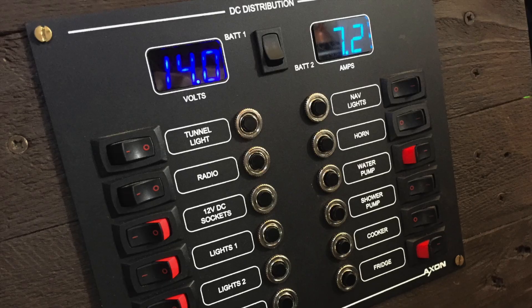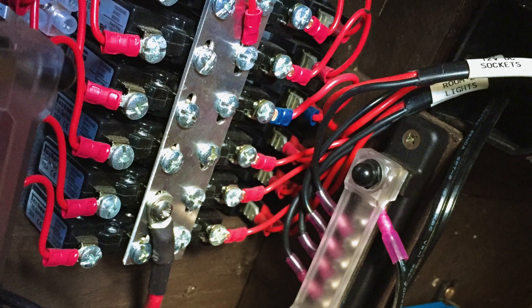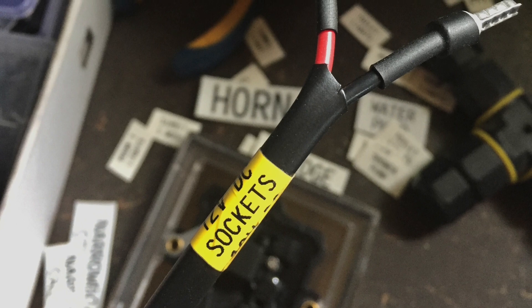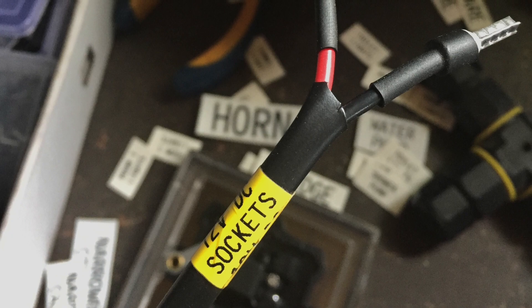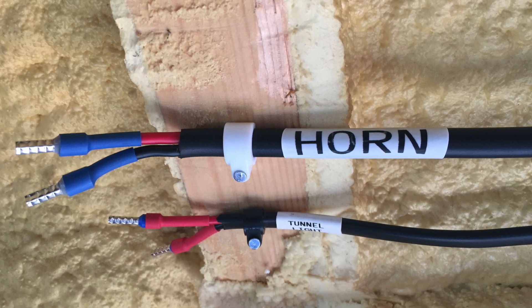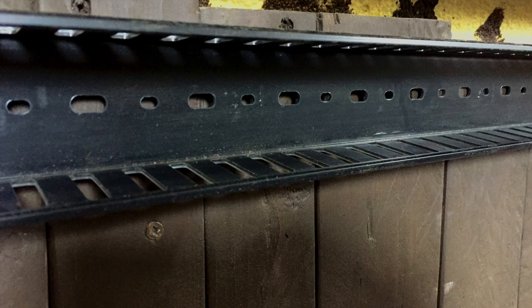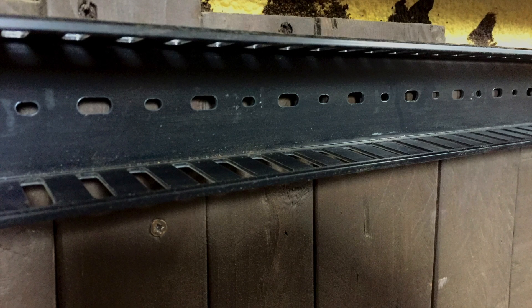I've got slate tiles on the bathroom floor which I quite like. This is where I started to take the electrics a lot more seriously — that's my distribution board or circuit breaker, and here's the back of it with all the electrics starting to go in. I labelled every cable so that lifting any panel anywhere on the boat I'd know exactly what it was. Although it took a long time, it was a good investment because if things go wrong in the future I'll know exactly what has. I ran industrial electrical conduits underneath all of the gunwales which all my electrics ran through.